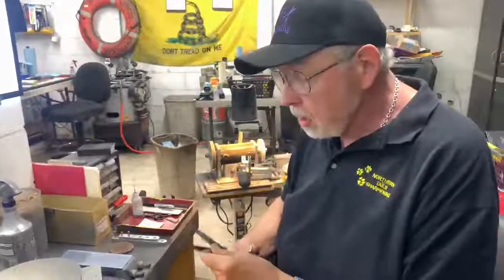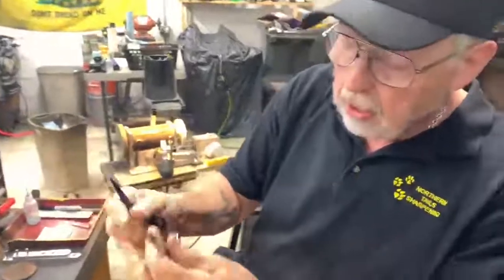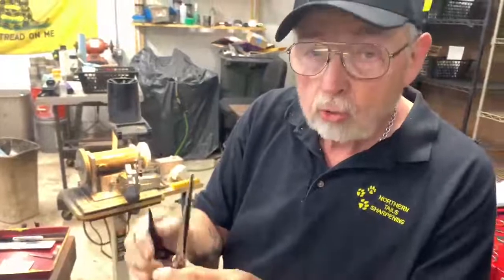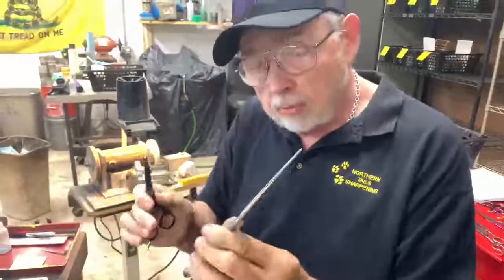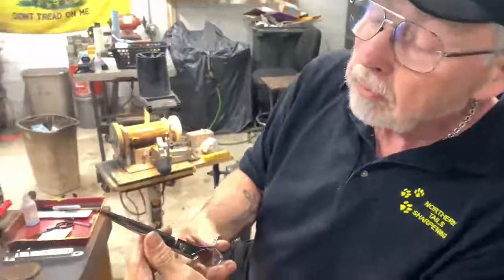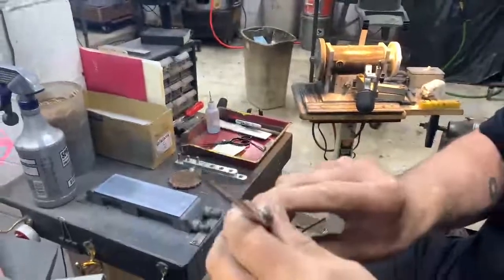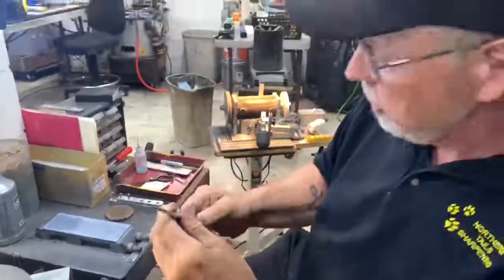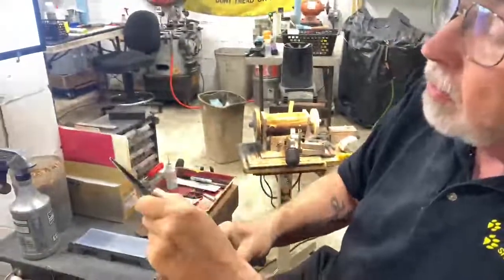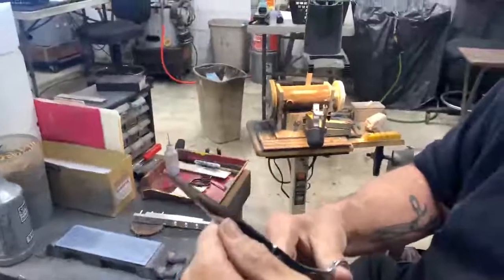One of the first things with any grooming shear — this is a salon shear that cuts hair, this is a grooming shear that cuts fur, a whole different thing, and we don't sharpen this one the way we sharpen that one. The first thing we do is make sure it's adjustable. As you can see the tips aren't really closing here, and that comes from being dropped. We take our handy-dandy handle bender and bend that back so she closes.